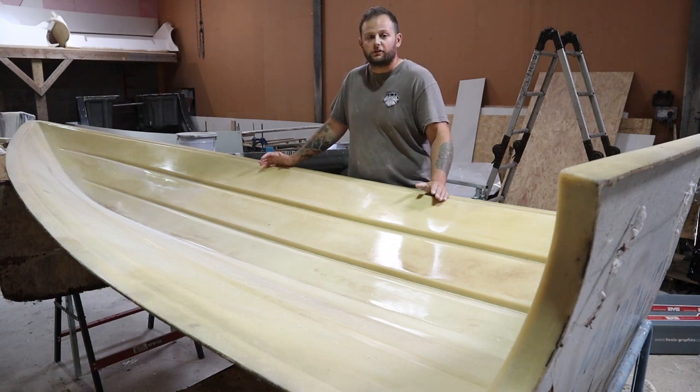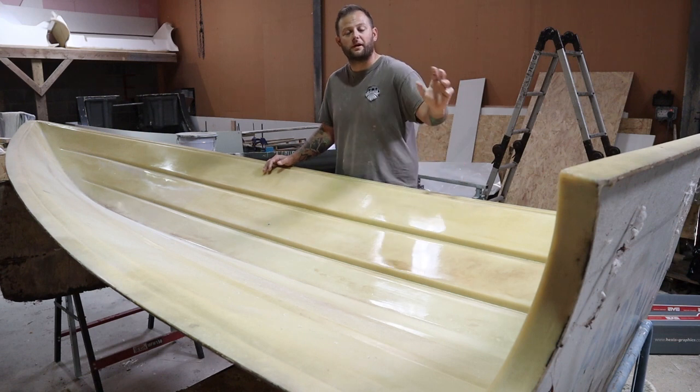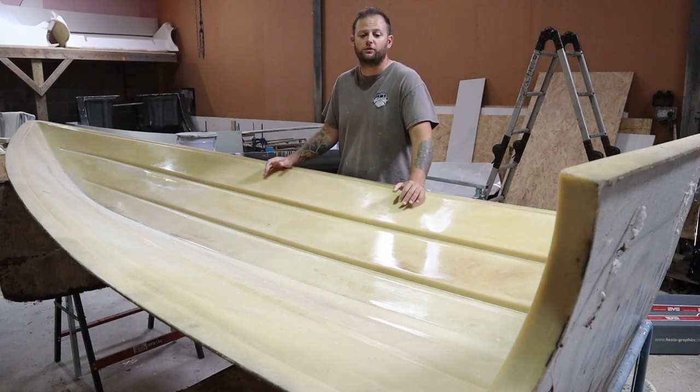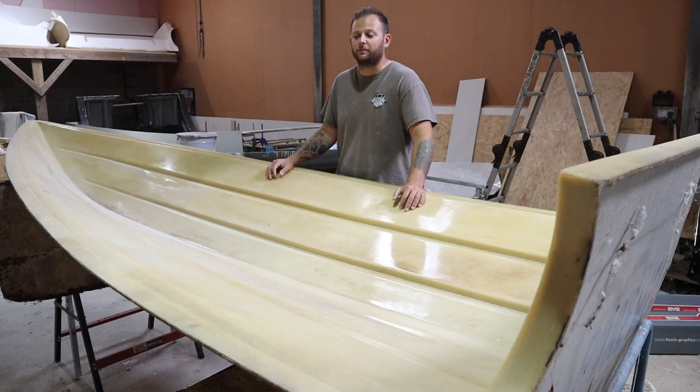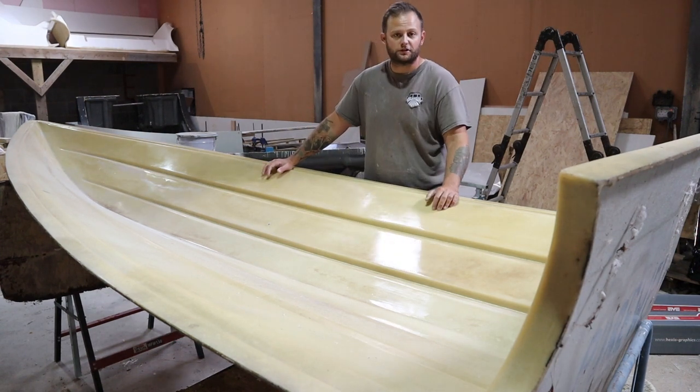So this hull is a nice little hull, relatively deep V on it as well. We've got a little flat spot on the keel there, which will help with some lift with the water flow. Just because of the weight of the engine, this boat doesn't exactly displace huge amounts of water. So all little things like that will aid in getting you on the plane and a bit of control as well. Okay, so as I say, we're running over the polish now.